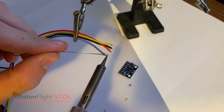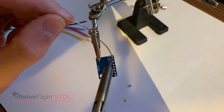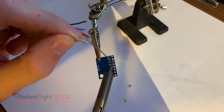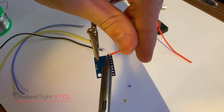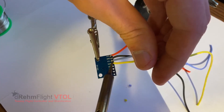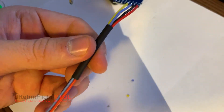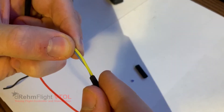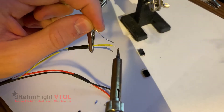Next up, we're going to solder the IMU. You're going to need four wires of the same length, and those are going to be soldered onto the VCC, ground, SCL, and SDA pins on the IMU breakout. The wires can be any length you want — it's just to decouple the IMU from the actual flight controller assembly so you can mount it anywhere in the proper orientation on the vehicle. I like to keep my wires clean, so I'll take some shrink tubing and run that over all four wires down to the IMU. Then I'll take the SCL and SDA wires and shrink tube those together, as well as the ground and power wires together.